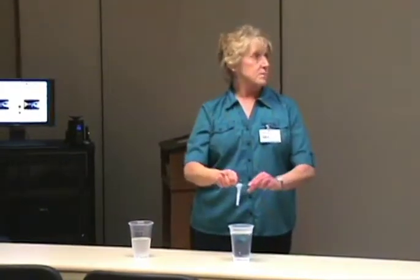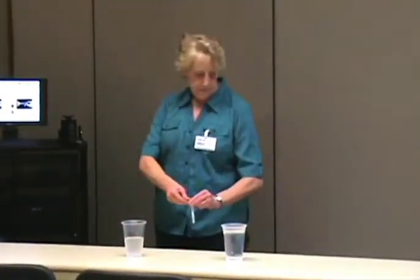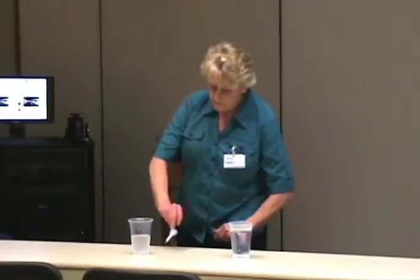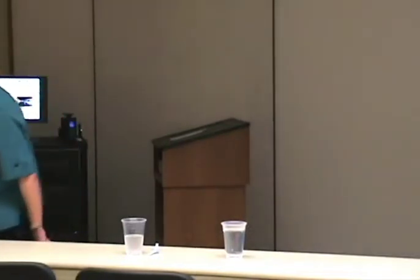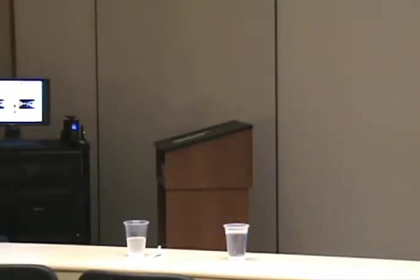Terry, how many other companies have a blue nozzle like that? Nobody. Just ICPS. So what's that do for our contractor? Peace of mind, he's not going to apply the product incorrectly, right? You could ask him, if he's complaining he's not getting enough yield, "All right, what temperature are you at?" "Oh, I'm going at 65 degrees." "Are you sure? Is your nozzle blue?" "Well, yeah, it's blue." "No, you're way too low."